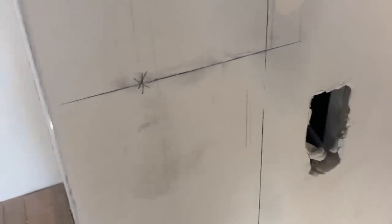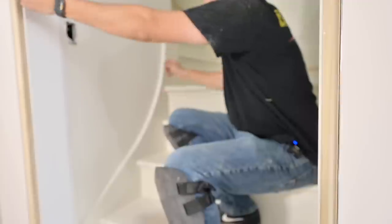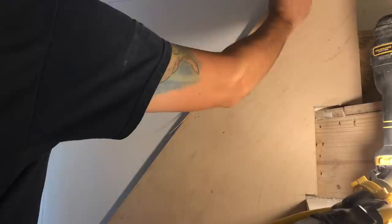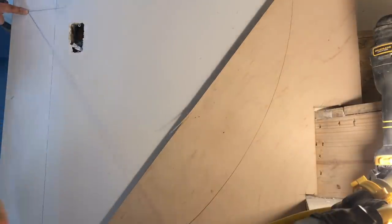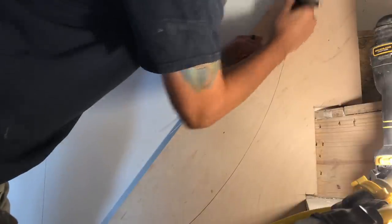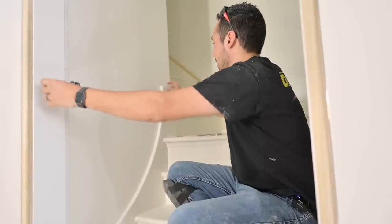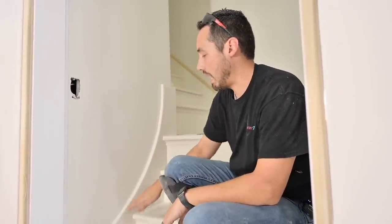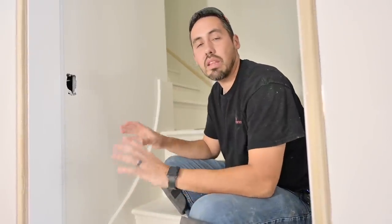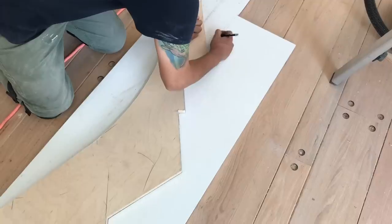What we did to accomplish this swoop: I took a chalk line, pinched it against the drywall with my left hand, put a pencil in the little hook hole on the other end, and just moved my hand around until I found the proper swoop I wanted. A really organic way of doing it. I just found that perfect point where it would meet up at the top and come back down to straight. Then we put our plywood template on there, traced it, cut it out, and laid that template on a piece of one-by-twelve.